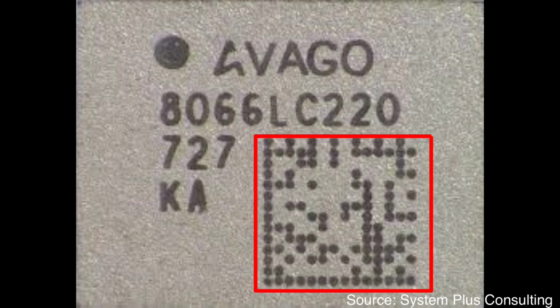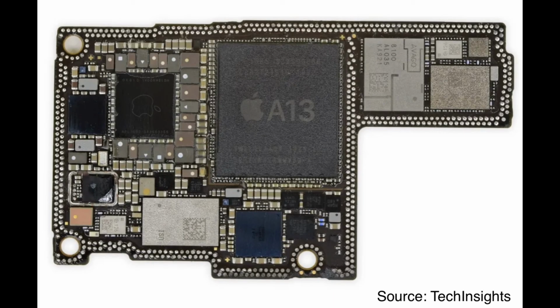Information can include lot number, manufacturing factory, manufacturing date and shift of substrate, die attach adhesive, mold compound, and so on. But it is not only for automotive, and smartphone also uses this 2D barcode for some SIP packages for RF devices. You also can see 2D barcode on substrate strip or wafer for unit level traceability.